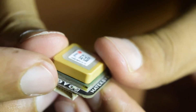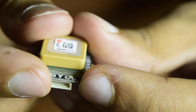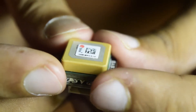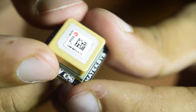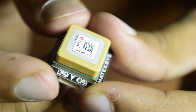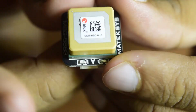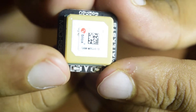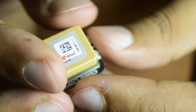On the top you have one power LED and one PPS LED. The PPS LED is on whenever the GPS location lock is acquired accurately, and the power LED is on whenever the module is powered on via the flight controller power circuit. There is also an arrow indicating how to place the GPS module on your drone frame, which you configure depending on the direction the arrow faces in your flight controller settings.